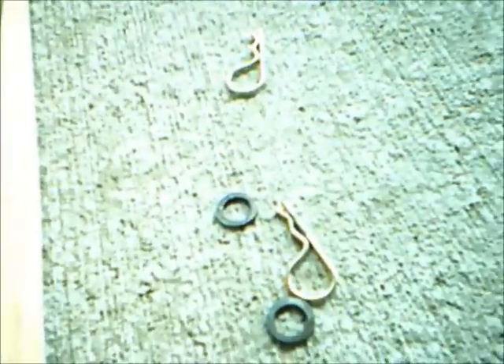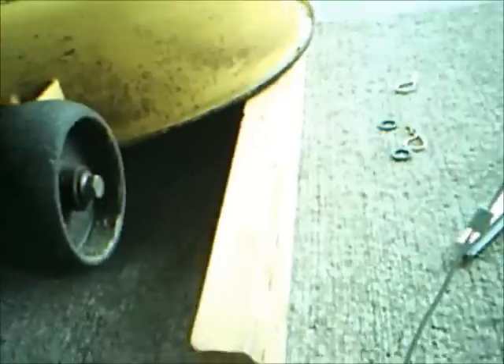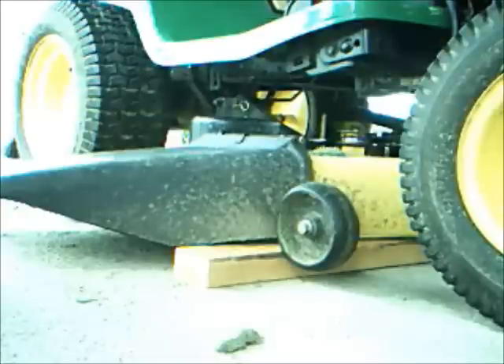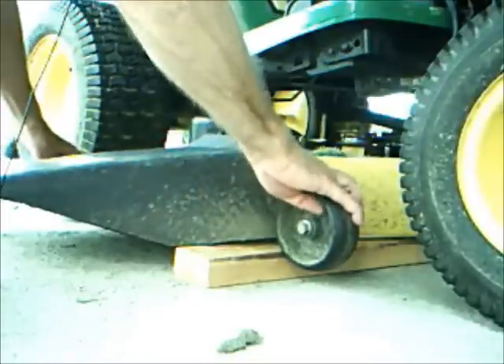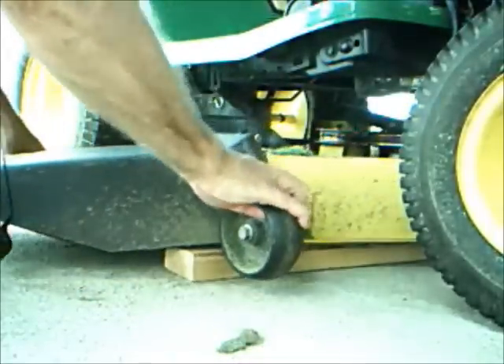Okay, so everything's loose now. There are the clips I took off on this side, and the washers — two on this side, two on the other side. Now we want to slide the deck out. We're going to take these two-by-fours that are on each side and slide them perpendicular, then use them to slide the deck on out. We put the two-by-fours underneath the mower deck on their sides so the mower drops down as low as it can, clearing all these brackets. These brackets will try to get in the way, so you want to make sure they're all removed, and simply start sliding it out.